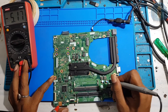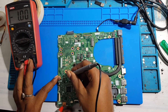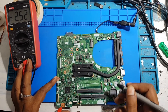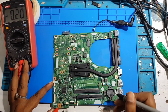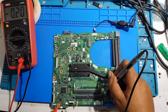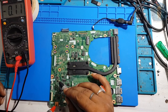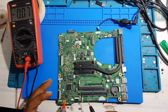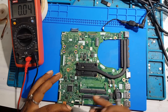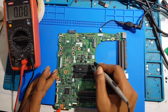In this condition we'll check if the voltages are okay. 5-volt and 3-volt are okay. 1.0 — also good. 1.8 — also good. 2.5 — also good. Let's check the RAM coil — it's only having 0.20 volts, meaning the RAM supply is not generating. 3-volt, 5-volt, 1.8, 1.0, and 2.5 are good. For DDR4, the 2.5-volt is the RAM requirement, and 2.5 is good, but the RAM supply is not available.